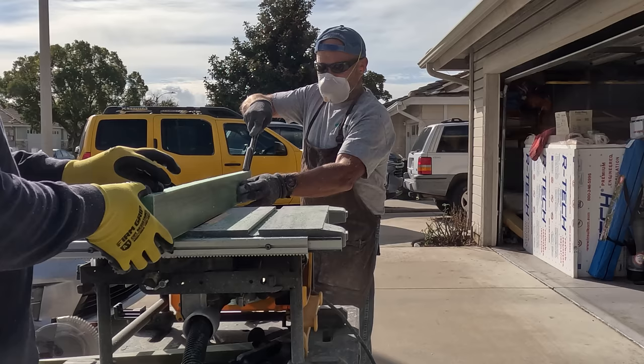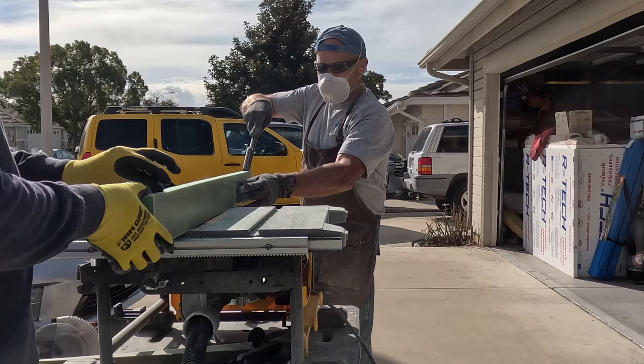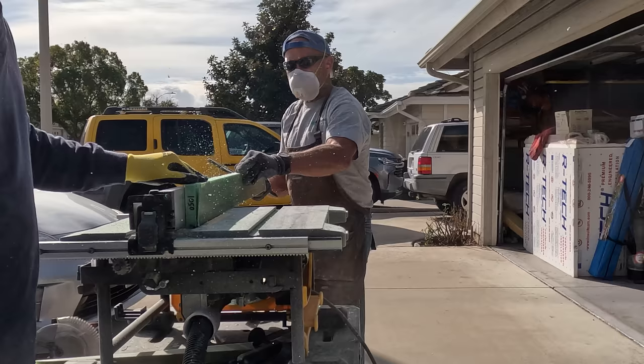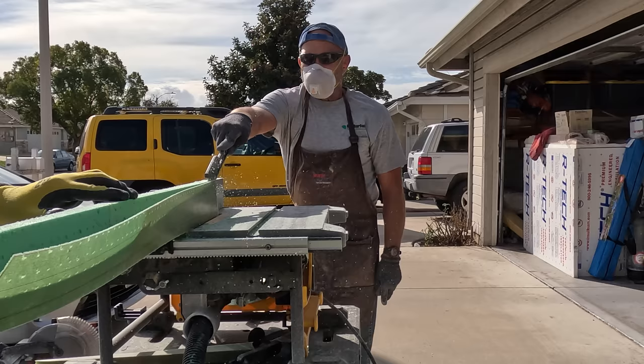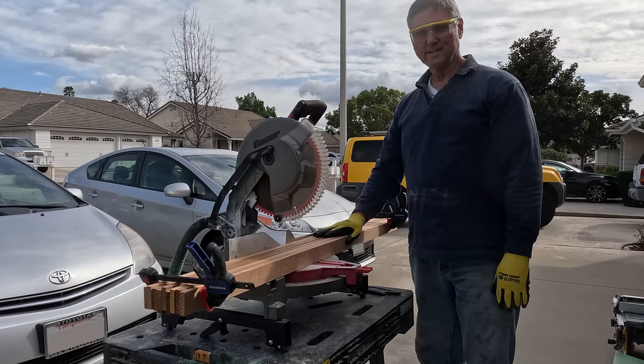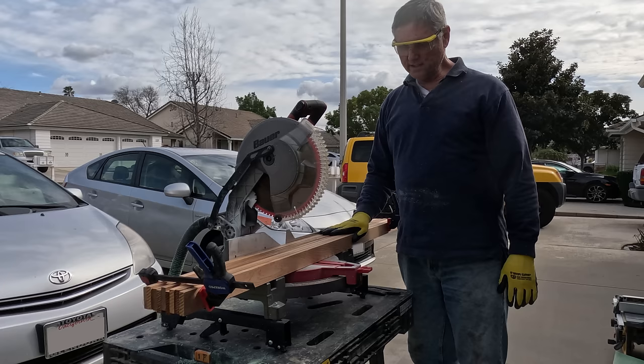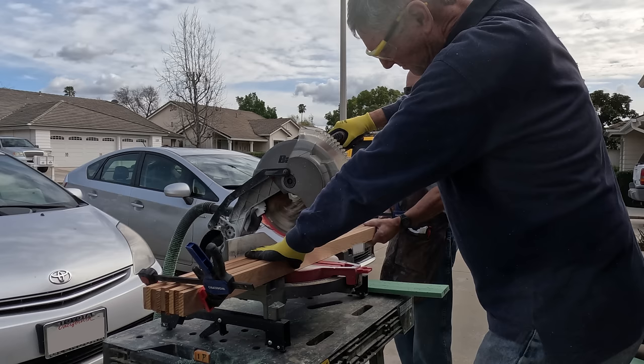Here we're cutting off one side of the fiberglass layers from a piece of foam strip with our small table saw that we borrowed from cousin Todd Blood. We borrowed as many tools as possible from friends and family since our budget is limited and tools can run up a lot of costs. Since our table saw blade wasn't tall enough to cut off the fiberglass layer in one pass, we had to flip each one over and send it through again. We also borrowed the chop saw from family member Travis Blood. The red cedar spine pieces also have to be cut to the same 800 millimeter length, so we butted them up at one end, clamped them together, and did one cut on all of them at once.